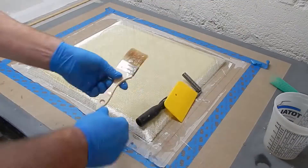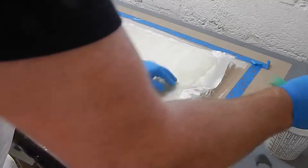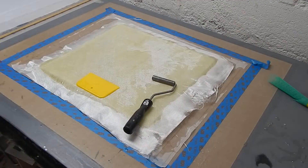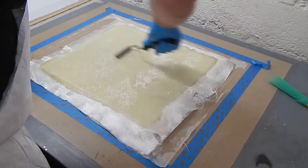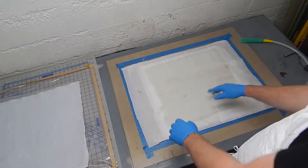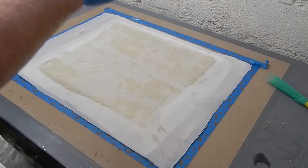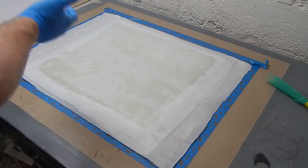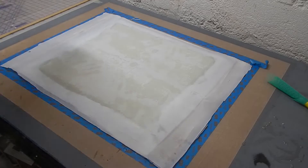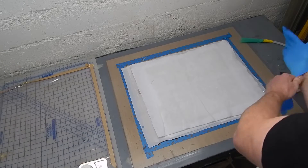Here's the top ply — it's still pretty dry. I'm going to trust that the bag will squish it down and wet out that last sheet of e-glass, and throw on the peel ply. This is polyester peel ply on this side. It doesn't look very wet, but if you put a finger down hard on it and you see resin pool in your fingerprint with no dry spot under your finger, that means you've probably got enough.